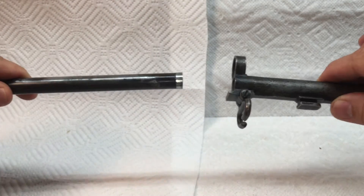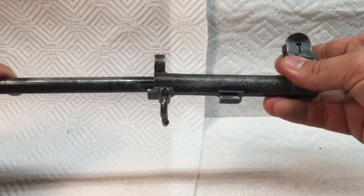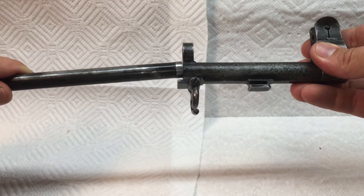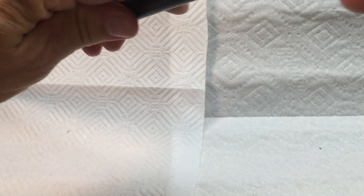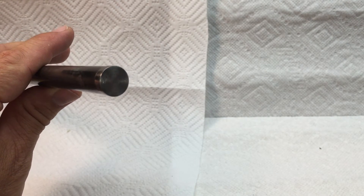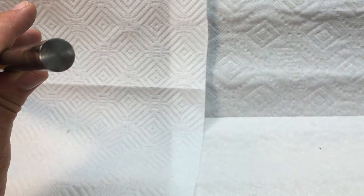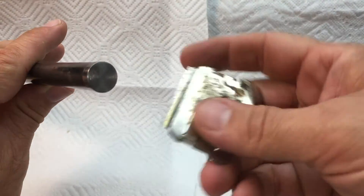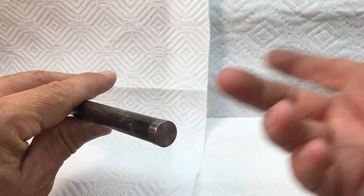What you're looking for is how this fits into the gas cylinder — there should be a little bit of play, a little bit of movement. There should be a lot more play towards the end because it's cut down so the op rod can be bent downward when disassembling on the rifle. For inspection, look at the head of the piston for any chips or burrs. The faces are usually dark in color. A straight razor soaked in CLP can clean it up nicely, along with some steel wool — I use 4-ought for almost anything.